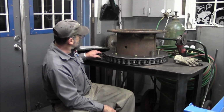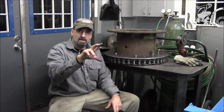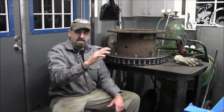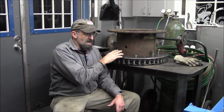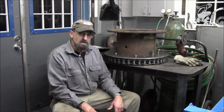We're looking real good, and we'll get some pictures and video footage of it down on the crane. I got to go down there and measure up the upper shaft, and I got to make a yoke and a shifter to shift the cog from raise boom into auxiliary, and that's what the pinion shaft that's going to be shifting in and out is going to drive this drum or put it in the freewheel. So you know, it's an old rig.